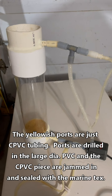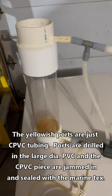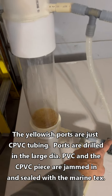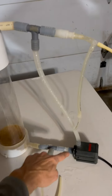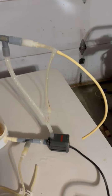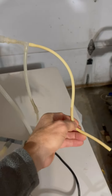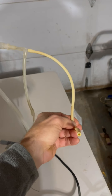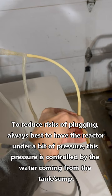This particular calcium reactor uses a recirculation pump — it's an Eheim pump, and I found those to work extremely well. The recirculation loop runs at very high speed, moving material back and forth through this larger-diameter line very quickly. You'll also have water coming in from your tank through this orange line — usually under pressure from a return pump. The easiest approach is to tee off of that and have it drip in.